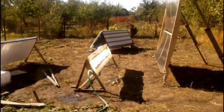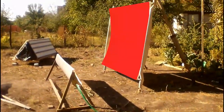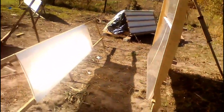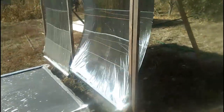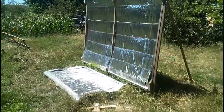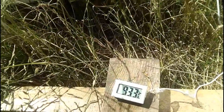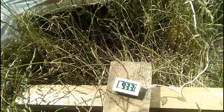This was my next step towards even simpler solar heaters, and these mirrors require changes in their vertical angle of only 10 times a year. This video will talk about my next step — an even simpler and cheaper solar heater which does not need those changes in the vertical angle, and its mirrors are absolutely motionless all 12 months of the year. Here we see that it heated the water to a temperature of 93 degrees Celsius.